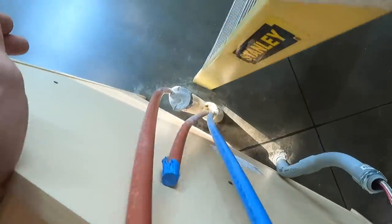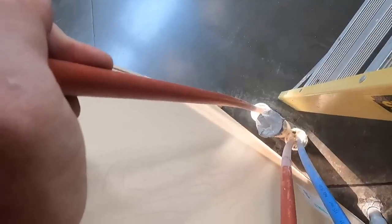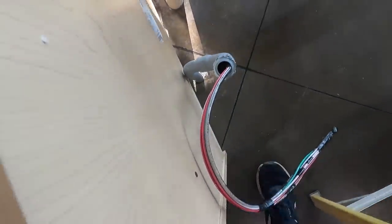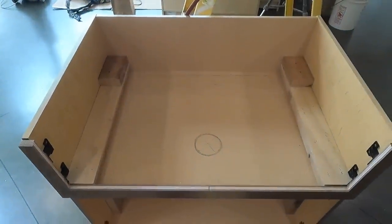We're marking for all the pipes. I've got water lines, one hot water line for our two dishwashers — we're going to have a dishwasher on each side of the sink — then hot and cold for just the sink. We also have electrical circuits coming up through here; there will be a junction box underneath. I have to cut this section out so I'll have enough room to reach up and hook on all the sink connections. That hole will be for the drain, that one for the electrical conduit, and then three more holes to cut.